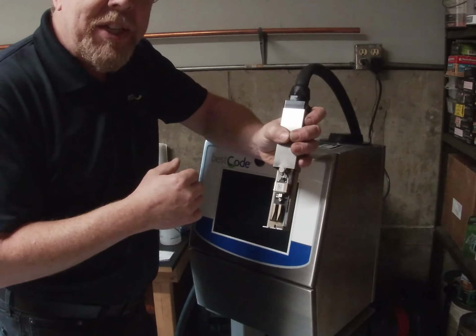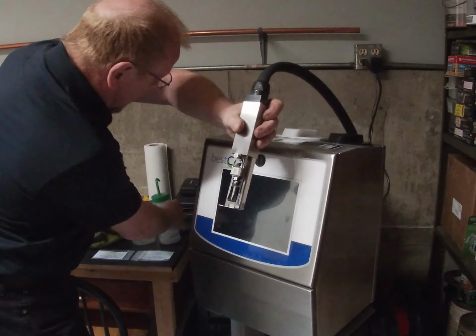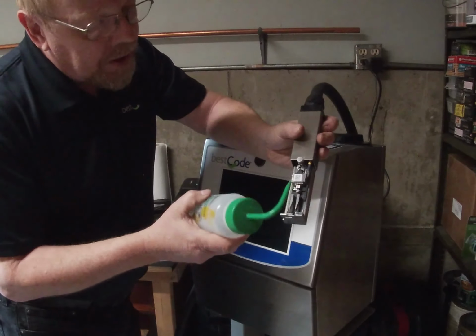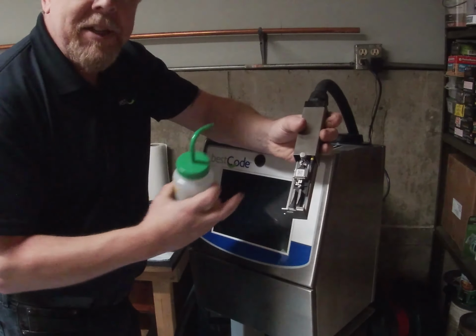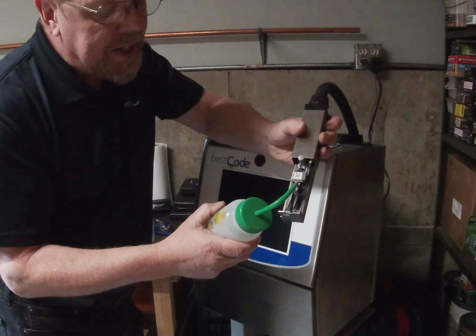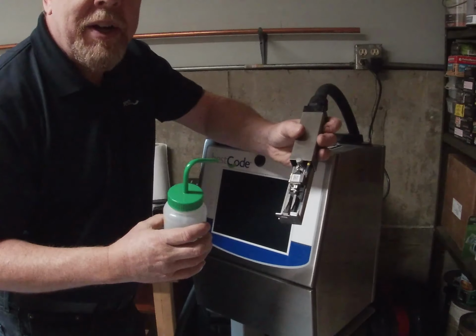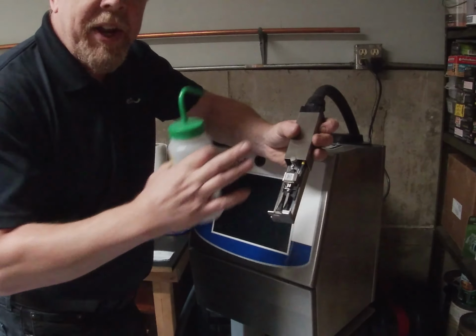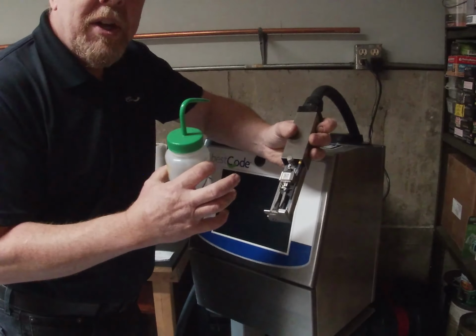I would try five or six of those back flushes, and that's purely getting your cleaner and literally aiming it up into the nozzle at the same time as hitting the back flush button and squeezing it, and you'll see the cleaner coming up into the tubes here. That gets rid of any debris that's collected in the back of the nozzle.